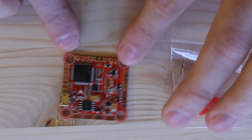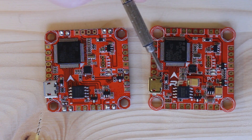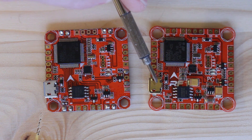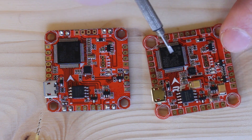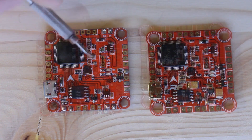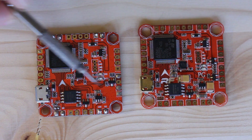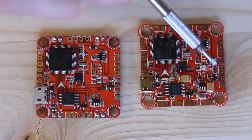You can tell these gummies are made to fit into the holes. This one's got the gold USB plug, which adds about 15 miles per hour to your racing drone. It's got the F405 chip, the InvenSense 20602 gyro. This is your UART side for your receivers, and the version 1 has one inverter on it while this one has two.